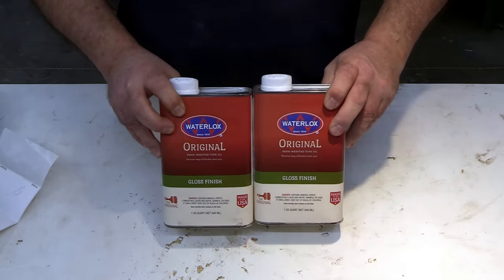And while this was an experiment, people are going to wonder, well, why didn't I do this on a smaller scale? The problem with doing it on a smaller scale is the epoxy in larger volumes will cure differently. So you really can't do it on a smaller scale to get the result you're looking for. That's why I didn't do a small scale experiment, because the epoxies will cure at different rates. Larger volumes are going to cure faster typically than smaller volumes.